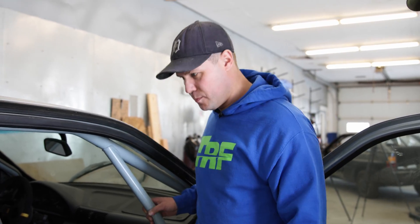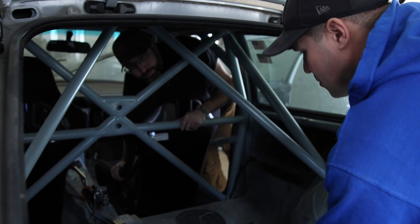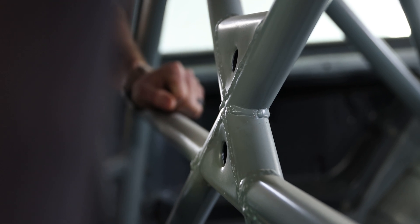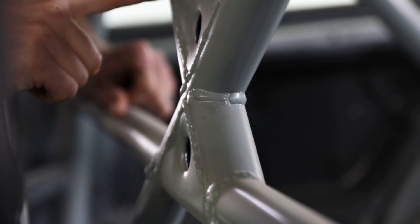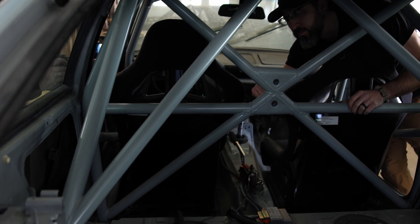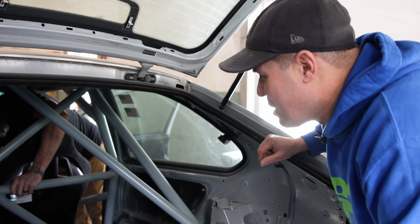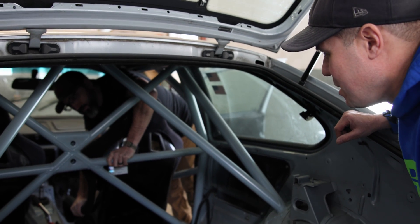So moving to the back of the car — what do you see here? First thing I see: giant gobs of weld just below your hand there at the harness bars where they're meeting the main hoop. It looks like the notches were probably not very precise in that tubing and they've used weld to fill up the extra air gap. You see it also on the ends where the harness bars meet the main hoop. Really, the intention is that weld is the adhesion to hold this together. You don't want the weld to be the structure, but if you're filling air gaps with large amounts of weld, that's really not an ideal configuration.